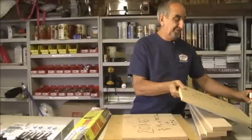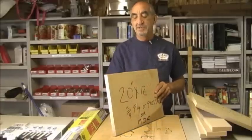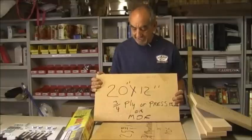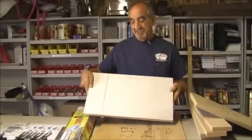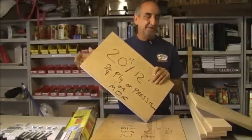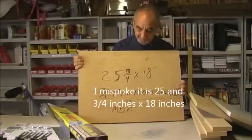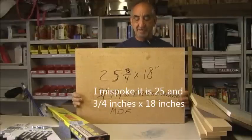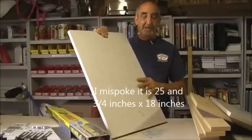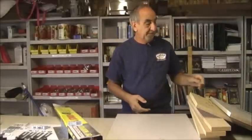The two other pieces you need — you can use MDF, but I just found scrap around the house. This is for the stand, so it doesn't have to be MDF; it can be plywood or whatever you have. You need a 20 by 12-inch piece, and the other piece for the stand is 25 by 18 inches — 25 inches by 18 inches, three-quarter inch thick. If you have scrap pieces laying around, use those. The main structural pieces must be MDF.